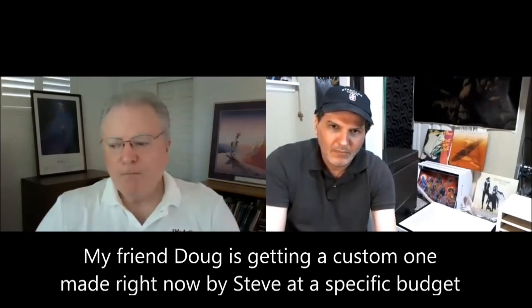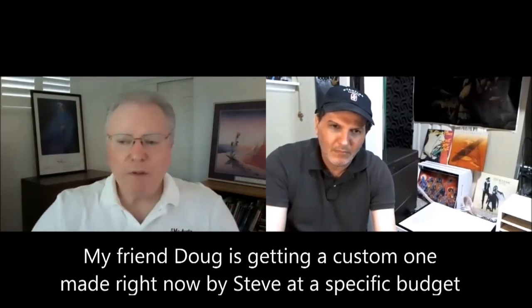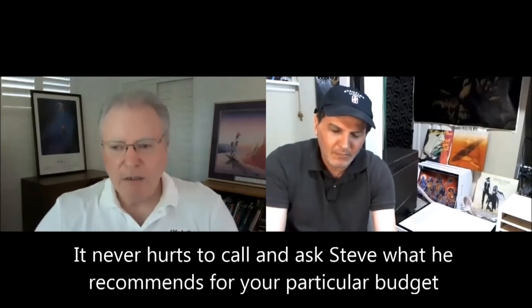I collaborate with Rick Brown of Hi-Fi One out here. He's got his business out here, and he's somebody who's really looking for ultimate playback systems and working with the clients that are interested in that sort of thing. And so I developed a version of the preamplifier for him that was between $50,000 and $60,000 more in that range, depending on certain options, with an all new power supply system, totally revamped, rebuilt, and cabling, and the use of silver wire transformers and silver wire chokes, and Duelund cast silver capacitors. And is that the one that also has a Panzerholz chassis?